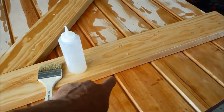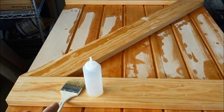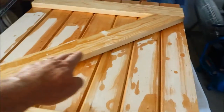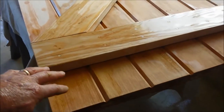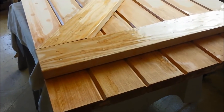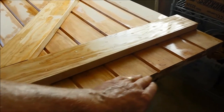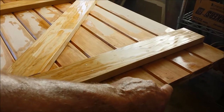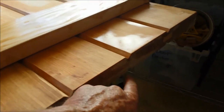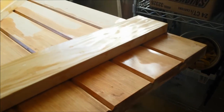Likewise, I filled every one of the cracks all the way down the door and the top edges of these reinforcing pieces. Down here at the bottom I was very liberal with it. The bottom of the door is where water can wick up through the grain of the wood, so it's very heavily applied down here. I'm going to apply even more down here because you can see it's already sucked up enough that it's light colored, so I'll put it on more heavily.